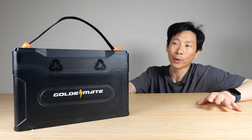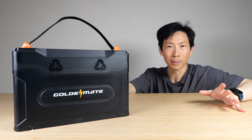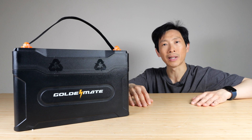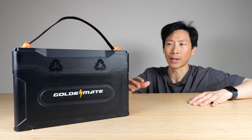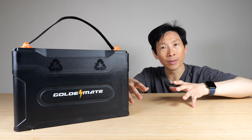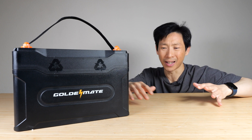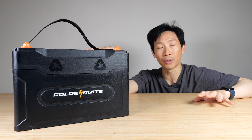In the battery manuals, it always says you can put four of these in series and four in parallel as well, so a total of 16. I would not recommend putting them in series because after using them for about six months or so, the voltage of each battery is going to drift a little bit away from each other. This drift can cause problems later on, such as over-discharge or overcharging of one of the cells. The battery manufacturers would actually recommend you take everything apart, charge them all up to full, connect a pair of them together, wait 24 hours, connect another one, wait 24 hours, and so on until all of them are equalized again, and then you can connect them in series again. These work well in a 12-volt system, but if you're going to go with a 48-volt system, you absolutely need to put in a battery balancer.